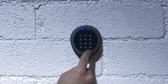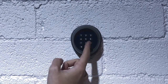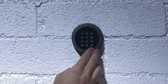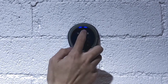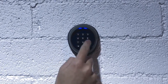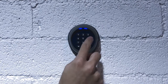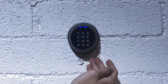If we wanted to change channel 2 from the default factory code of 2-2 to 5-6-7-8, it's the same process except reversed for the other side. So we hold down 0 and press the enter key for channel 2. That long beep signals it's ready. We enter in the current passcode of 2-2, and then 5-6-7-8, the passcode we want. Then 5-6-7-8 again, entered in again with the channel 2 enter key. The long beep confirms it has been accepted.